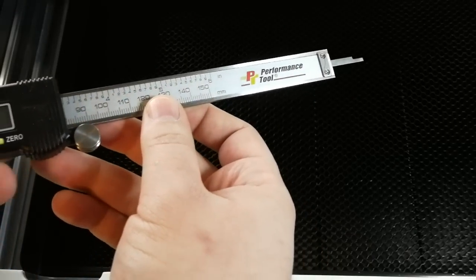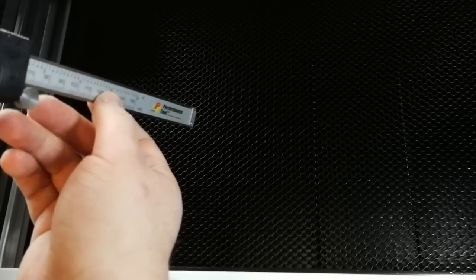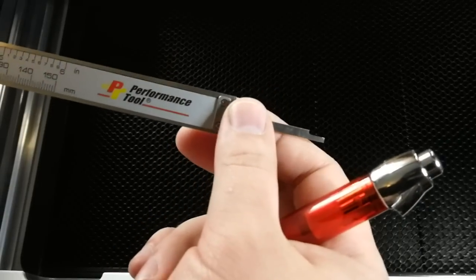We're going to go right along the side of it. It's kind of tricky to do while it's in there, but you're going to hold your digital caliper kind of sideways and use that end to measure. Set it right along the edge like this and open it up. I know you can't see the measurement right now, but I'm going to tell you what mine reads — mine is reading 1.503. So we're going to write that down. You're only going to have to do this once.